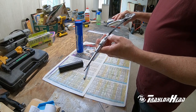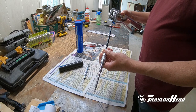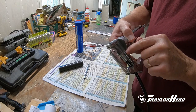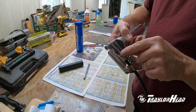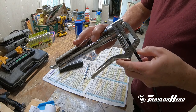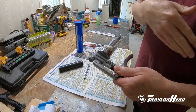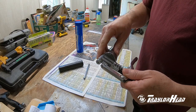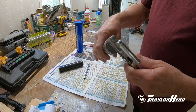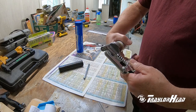When I put the thread on, I used thread tape so I could get it tightened up. Also on this gun, this spring gets in the way when you're trying to get the nut tightened on the hose. What I ended up doing is drilling out the rivet. When you do that, this spring tension will pop everything out — so be careful. But once you get it in there tight, everything's good. You can just put a bolt or a pop rivet back in and it works fine.